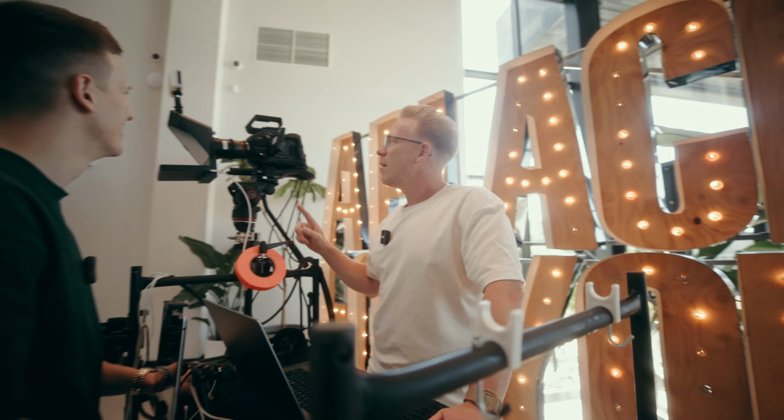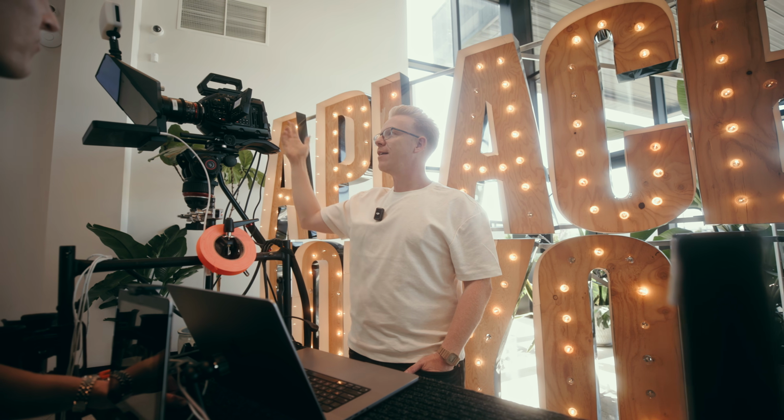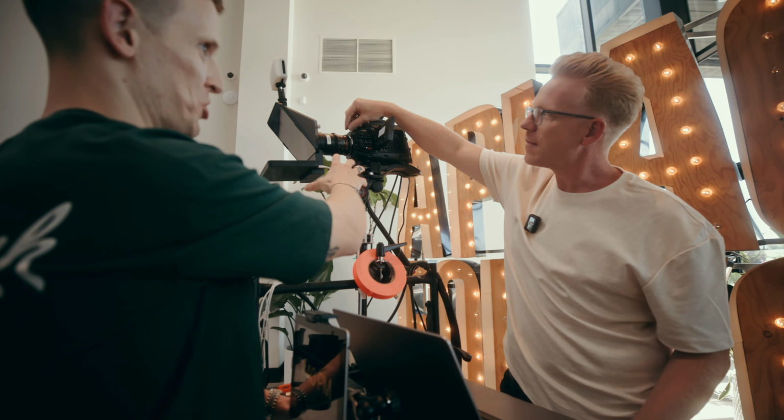What's great about this setup is we're running an output to our ATEM switcher in the back, an 8K Constellation, but we're also running an input. That gives us control. For each service, we're taking the exposure up and down through production ISO, which is called gain. So we're putting the gain up and down based on the light. And that's from the booth. So from the booth that we're going to go to later, you can control the exposure via the ISO, because this is an aperture that you cannot control remotely. That's correct.